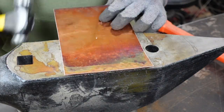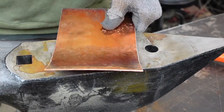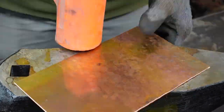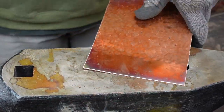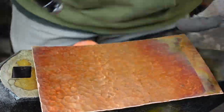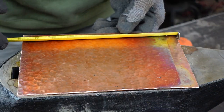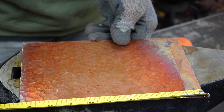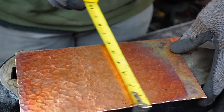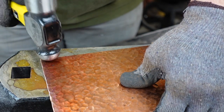I want to leave as little space as possible between the metal and the anvil. This will make it curl up, so you want to flip the material back over every now and then and hit it with a mallet or the flat face of the metal hammer. Just work your way all the way to the other edge of the metal and make sure there's a dimple everywhere, then flatten it out. I'm going to check my measurement — it will actually grow a little bit after you hammer it and will be fairly hard at this point, or at least back to the half hardness which we started with earlier.